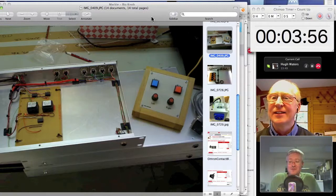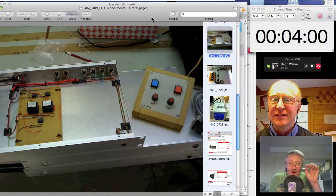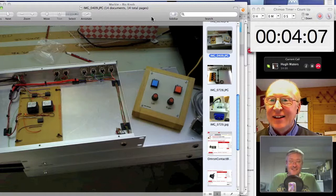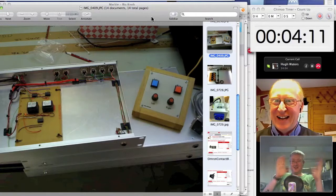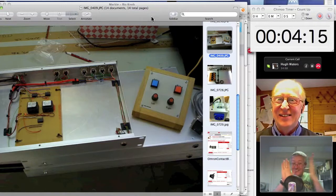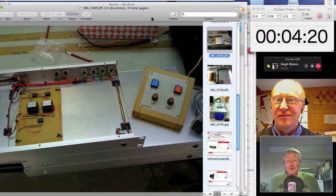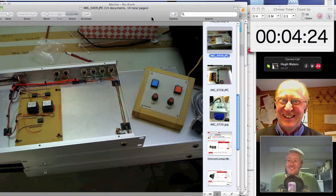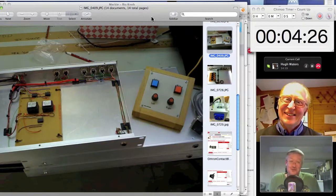So the MD said to me, well, you're working maintenance this weekend. I'd like you, using Kynar wire, to wire in A15, the 16th address line, on this processor board. And I did. But by the end of it, it was a rat's nest either side of the board, just fitted into the card cage with lots of tiny tie wraps holding all these wires in place. It was about as stable as Charles Manson, but it meant we didn't have to buy another processor board and saved the £800 or something.